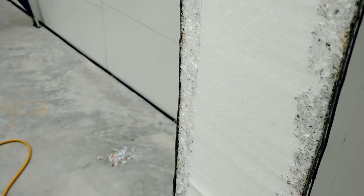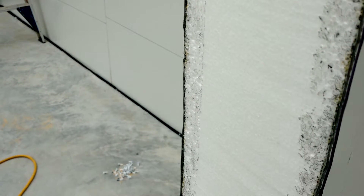You get a cut that is very, very clean, flat, and neat — for maybe a doorway or a window where you want to fit the architrave round and also the reveal of the window. It just makes it less bumpy and less of a problem. And also, using the hot wire, you get less mess of foam bubbles everywhere.